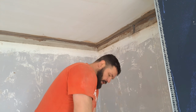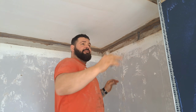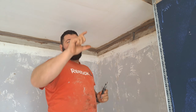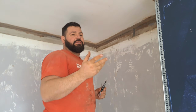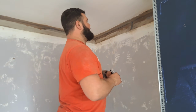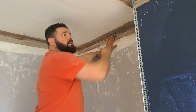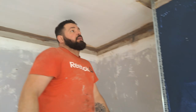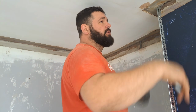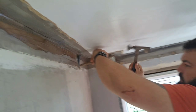It's not too thick for us to get some of these little patches with just finish whilst we're skimming. Whilst we're on the first mix, I'm at the ceiling, the front of this, Kieran will get a few bits, and I'll go round and fill some of the other bits out with what's left of the skim, the finish, and then next mix they'll be good to skim over, rather than having to go and buy a bag of bonding that we didn't account for, and having to mix up separate buckets and wash out and all that. We'll just do it with a bit of plaster.